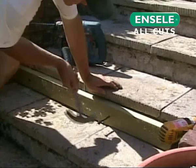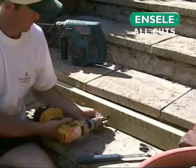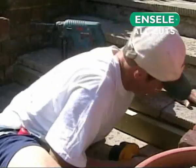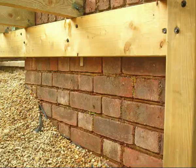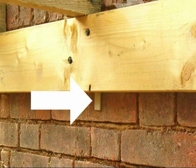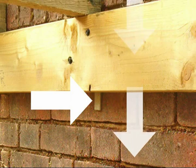Because our deck design incorporates an existing wall and steps, a ledger board will be used to act as an extra beam to fix the joists to. Ledger boards, cut from both 44 by 97 mm and 44 by 145 mm Q-deck joist material, are screw-fixed to the wall and steps along their lengths. These boards should be packed away from the wall and steps by at least 10 mm, using either several washers around the screw fixing or galvanised bars. This allows adequate water drainage.